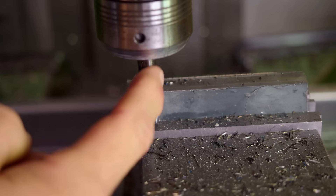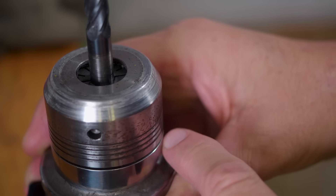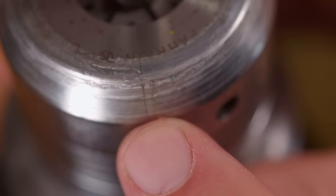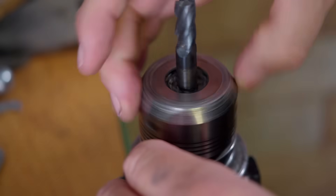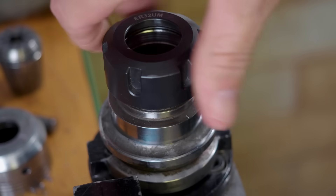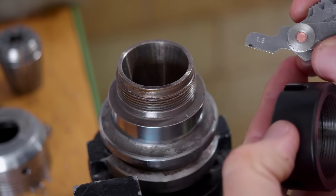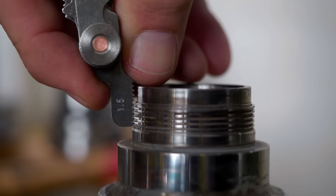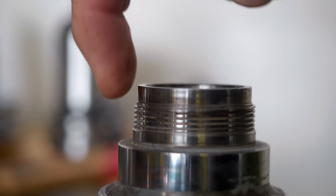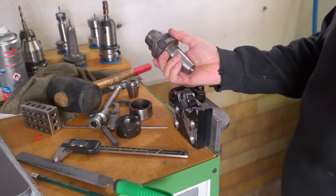What we had here was the tool pulling itself out of the collet. I was going to take this out and tighten it up — that nut is definitely toast. I wonder if this has got the same thread as a normal ER collet nut. A normal ER32 collet nut has got a 1.5 pitch thread, and this looks like it's also a 1.5 millimeter pitch. The difference is the thread form — instead of a normal 60-degree V, this is a square thread. Might be useful for something, but it can go back in the drawer.